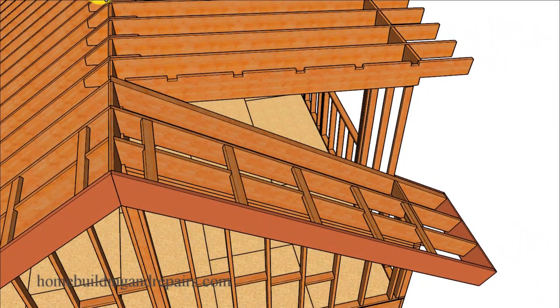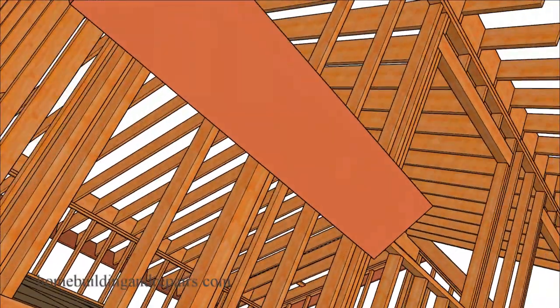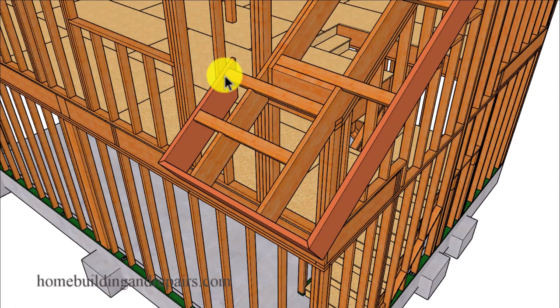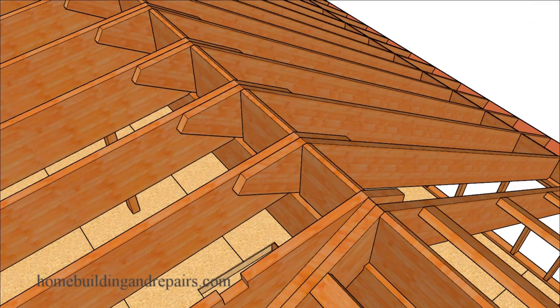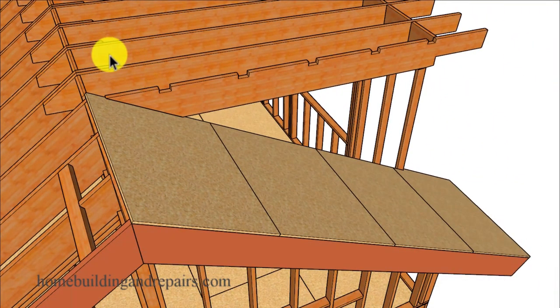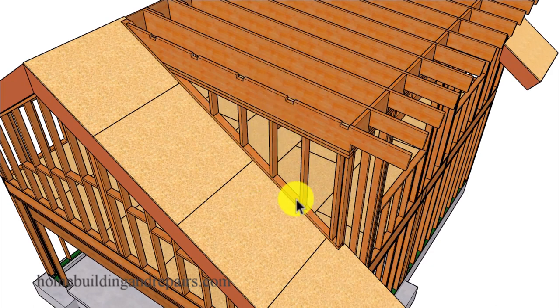Take a look at the top corner with the fascia board. We're simply going to attach the fascia board to the beam on this side to provide a detail that might work for your project. However, if you want an overhang you can install a couple of lookouts to support it. Our shaped ridge blocks along with the lapping rafters — again 16 inches on center — will give a nice structural tie between the back and front rafters after about 10 to 12 nails. Remember, you'll need to install the roof sheathing before installing the wall underneath the rafter and on top of the beam.